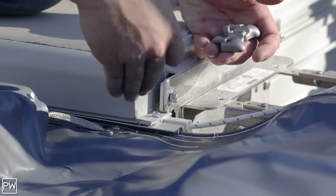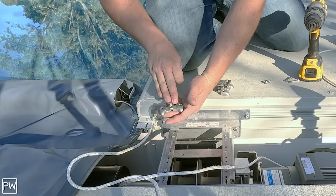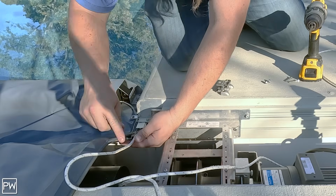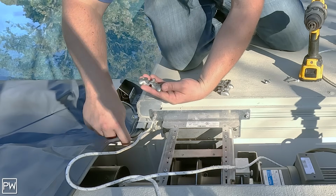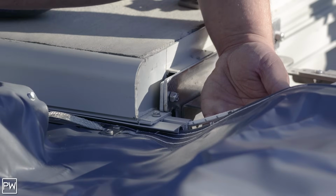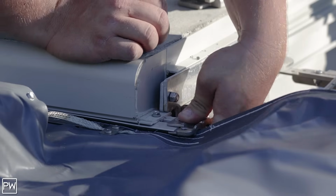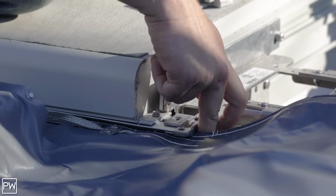You have to have your slider in the track and pushed up several inches past the end of the track before you can put these on. If you try to put these on and then put your slider in the track, it will not work. So we're gonna hold our bottom down. We've got both of our channels here. One's gonna hold our webbing, the bead of the webbing, and one's gonna hold the rope, just like that. Same with this, there's 2 channels here. Those are gonna straddle the rope and the webbing. Once we've got that assembled, slide it right onto the track, okay? That's how the guide slides on.